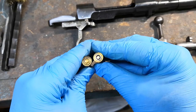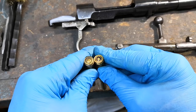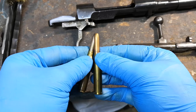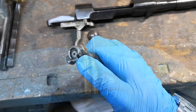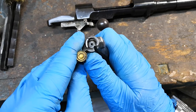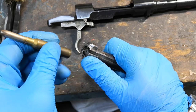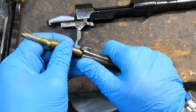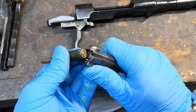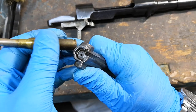In part B I give a detailed description of the 6.5x52 cartridge used by most of the Carcano rifles, but now I'd like to point out a peculiarity of the design which, as far as I know, wasn't used anywhere else. The case head had a circular depression with a matching depression on the bolt head, which had the main function of reducing the area of the case head in contact with the bolt head, therefore increasing the contact pressure. This was thought to be helpful in reducing the escape of gases from the primer pocket. In case some gases were to make it through, they were ducted through the annulus to a vent machined in the bolt, from where they could escape out of the high pressure zone.